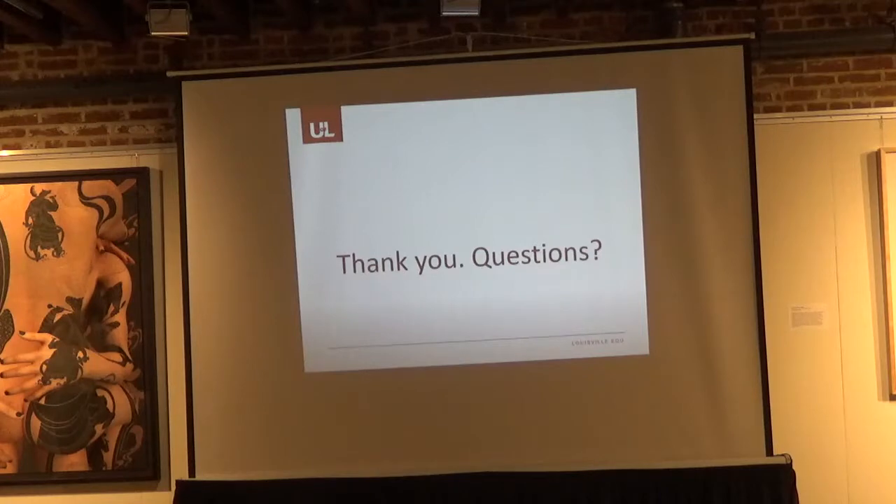Audience question: Have you considered other valve types? With check valves you have to worry about deflection. But if you think about a ball-and-cage valve, it doesn't need any deflection of any structures — it's purely based on solid structures and flow; that ball can move in a ball-and-cage valve. Have you considered 3D printing some of those? The resolution might not be there, but that way you don't have to worry about deflection, and you can 3D print it in any direction as long as you can 3D print a ball and cage.